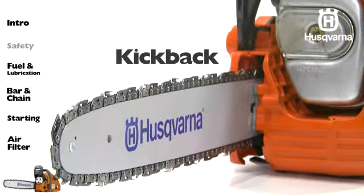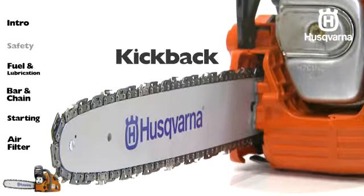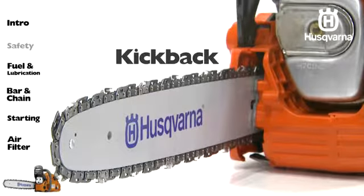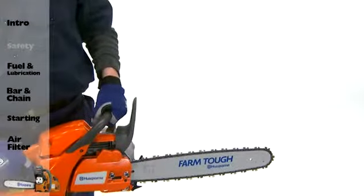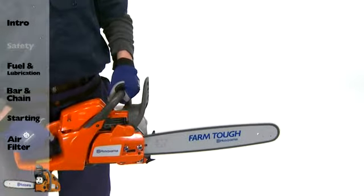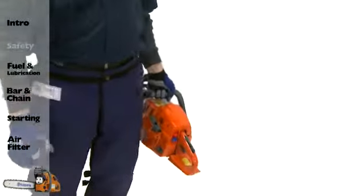Kickback can be very sudden and violent. Most kickbacks are minor and may not always activate the chain brake. If this happens, you should hold the chainsaw firmly and not let go. Use the chain brake as a parking brake when moving over short distances in order to reduce the risk of a moving chain accidentally hitting your leg or anyone else's leg.